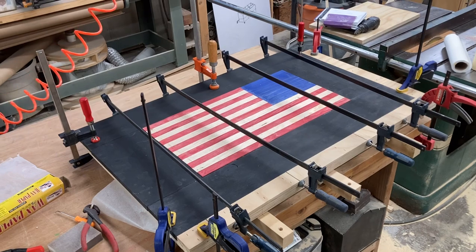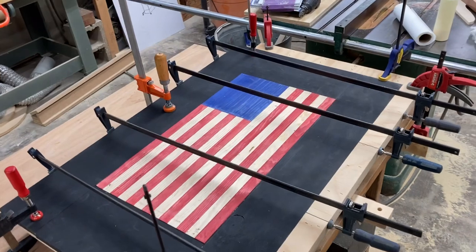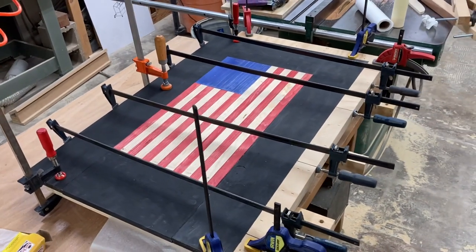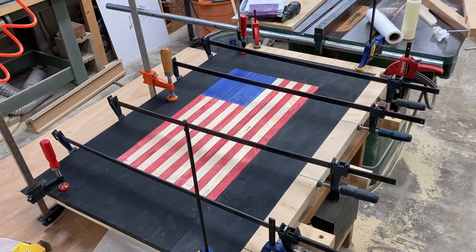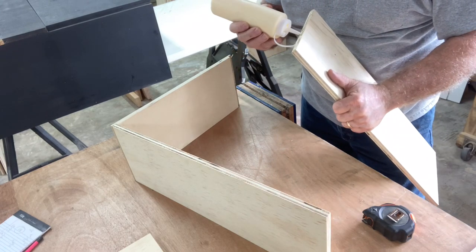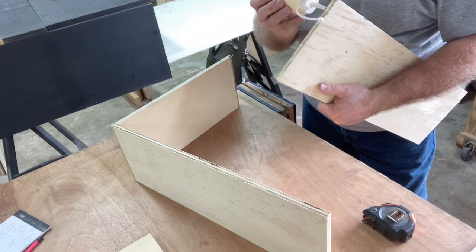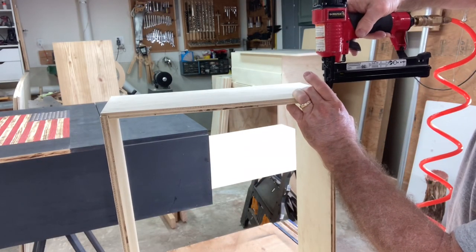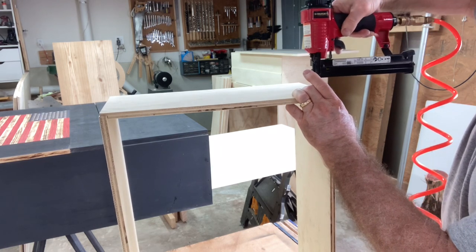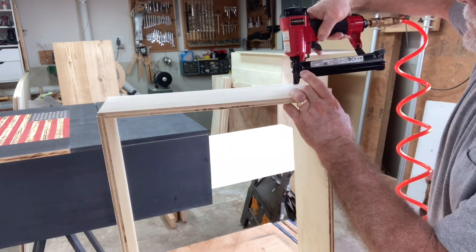It's time to go ahead and assemble this now. The black around it is part of the top of the cabinet, so in essence this flag is an inlay into the top, and I think it's going to look really great. Moving on to the building of the drawers, I'm using the exact same technique I've used before — I'll put a link to that video in the description below. I'm not going to waste your time on how these go together, but I'm using the rabbet joints on the ends and just glue and nails to assemble everything together.